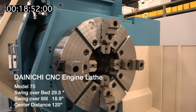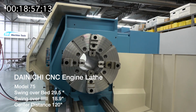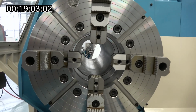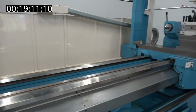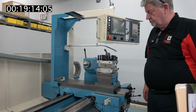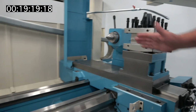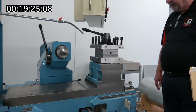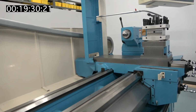And this is the flatbed lathe hybrid type. It comes with a CNC control, ball screw, and servo motor, yet it still has the ability to run manually. Ideal for short run parts, maintenance, and that kind of stuff. When you're operating this machine, you're going to turn the hand wheels to go in on the carriage, or if you're going to come up and down the headstock. I think this is the jog stick where you're going to be able to jog it, or you can turn it for the fine graduations.